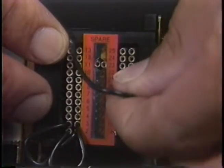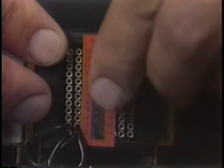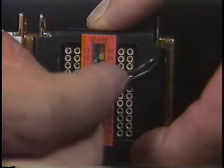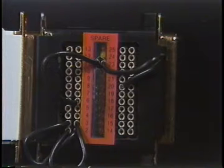There is a spare LED position too. The spare position shows yellow for negative and red for positive voltage signals. To use the spare, jumper from some source pin over to either of the two spare position sockets. The two spare sockets are tied together in common, so you can use a second jumper wire to continue to a destination socket. When all of the jumpers are in place on the back side, voltages from either side will light the LEDs.